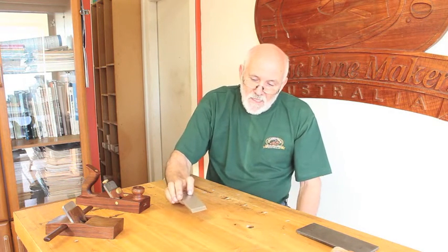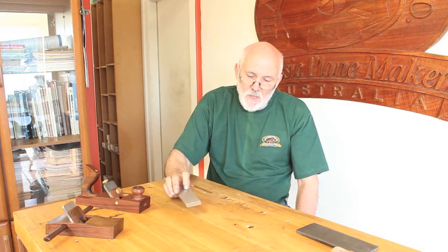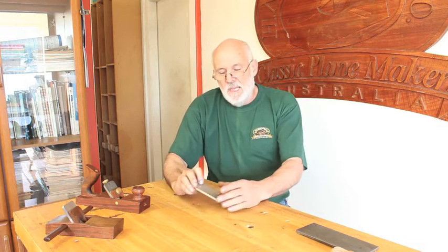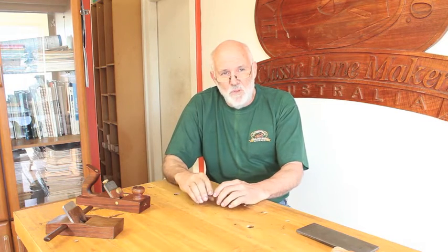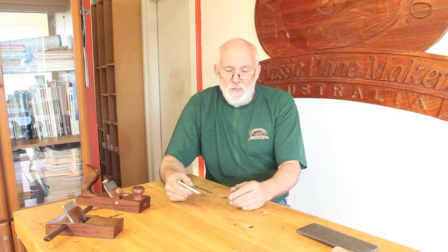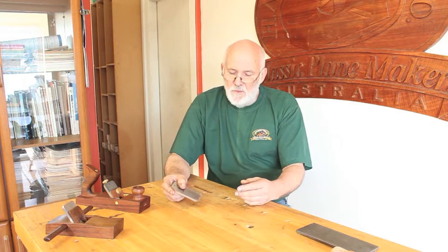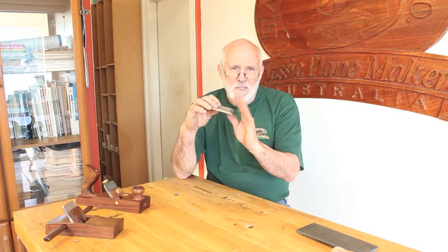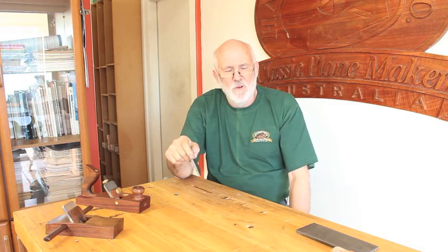When they were planing large flat hardwood surfaces, they found that after a certain amount of time the plane would balk at the cut or skate across the surface. That alerted us to check things out a bit more than we had. When we first heard of low angle bevel up planes sharpened with 50-degree bevels, we didn't think that was a good design, simply because of that high blade bevel and the problems I just mentioned.